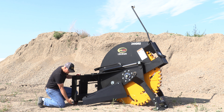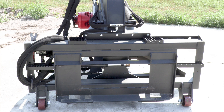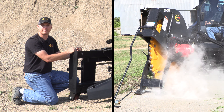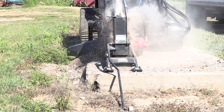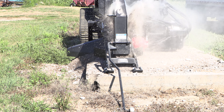Additionally, we have two wheels here on the bottom of the frame. These are your contact points when you're actually cutting so that you don't have to support all the weight. The rear of the machine is supported by the wheels while the front is supported by the two skids. Also here we have the side deflector. This is going to push the spoil material off to the side so that you don't have to drive over it with the tracks or wheels of your skid steer loader.